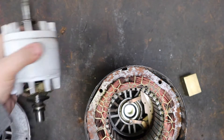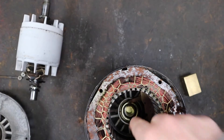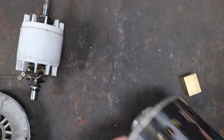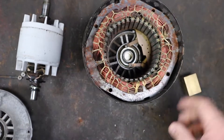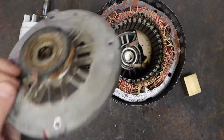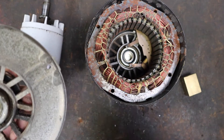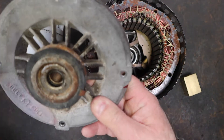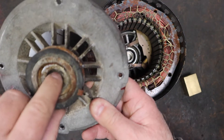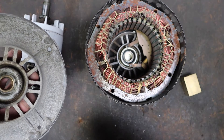There's a ring in there. So there's the armature, often called the rotor, and there's the stator. There's our other bearing down at the bottom — we'll pop that off here in just a second. Pressing that one out and pressing it in is the same as pressing this one. So let's head over to the press, knock out this bearing, get the end bell up on the lathe, bore out the bore so it'll fit the new bearing, press in the new bearing, and then we're done.